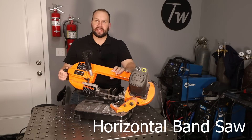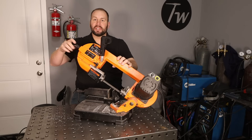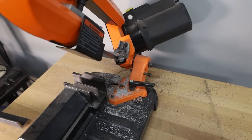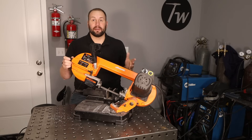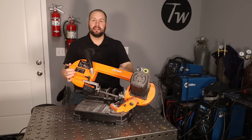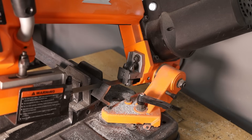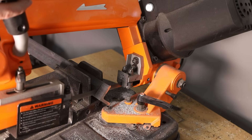Let's talk about horizontal band saws. A horizontal band saw is basically like a portable band saw but it can open, close, and pivot — kind of a combination of the chop saw and a band saw. Some things I really like: these tooth blades work great for cutting steel or aluminum, pretty much whatever you throw at them as long as you get the right tooth count on the blade. They're also quiet — a lot quieter than a chop saw. On the other hand, they're quite a bit slower. But you end up with a relatively clean cut without a lot of burrs to clean off.